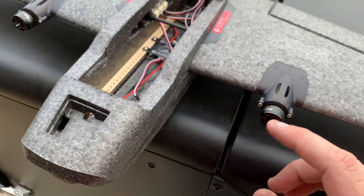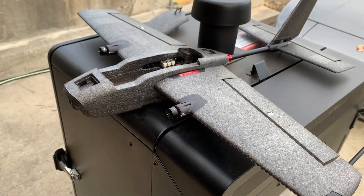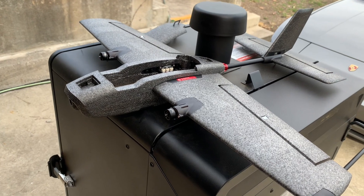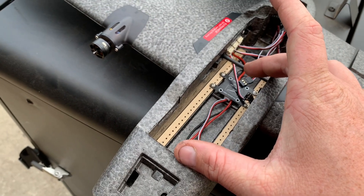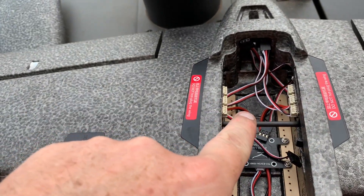For the battery, I checked the motors and ESC on the website. The plane says it's for 2 to 3S, but I found that the electronics are capable of 4S, so we're going to do a 4S lithium ion pack. 2600 milliamp should fill up this whole space right here. Hopefully we can balance.